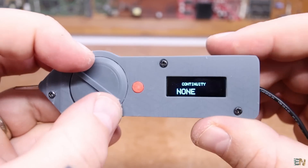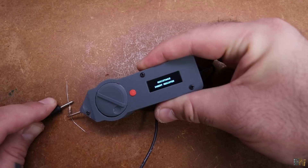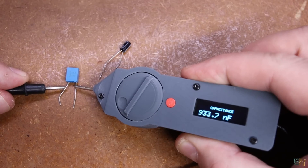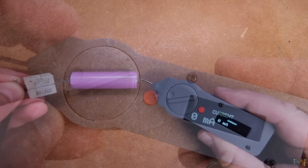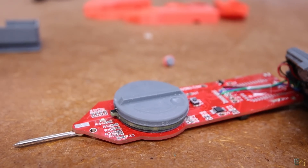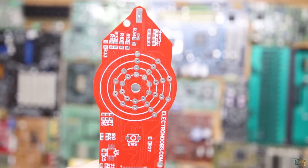Turn it on and start measuring. I can measure the voltage of any battery and values up to 60V, both in positive and negative mode. I can measure different values of resistors up to megaohms, test for continuity on PCBs or for short circuits, test diodes for reverse voltage, measure all values of capacitance, and also frequency. In current mode I can now easily measure up to 2A or more, though I haven't tested beyond 2A yet. The PCB also now has a fuse for safety. So that's how I've made my new multimeter.